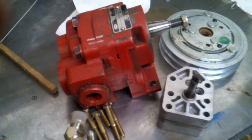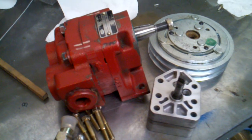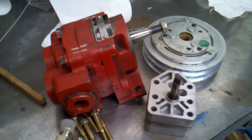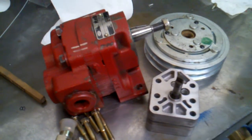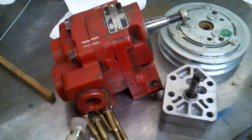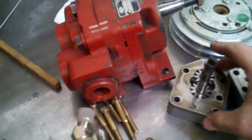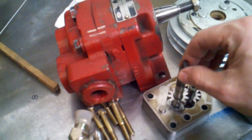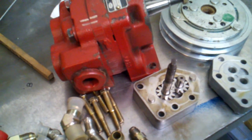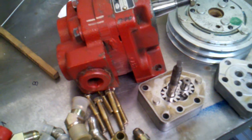In comparison, I have a Fenner pump on my plow right now, and I did put a 3.2cc bigger gear pump in it compared to the 1.2cc that came stock. It is a lot faster and does draw more power because you're compressing more fluid. However, it doesn't lift my Diamond plow quite fast enough — I want it to be really fast. Fisher Insta-Acts are pretty fast, but they just don't have enough — I tried it on my plow and it still doesn't lift the heavy Diamond. The Fisher Insta-Acts put out about 1.2 gallons per minute at 2,000 RPMs because those electric motors spin about 2,000 RPMs. My Fenner puts out about 1.7 gallons per minute at 2,000 RPMs.